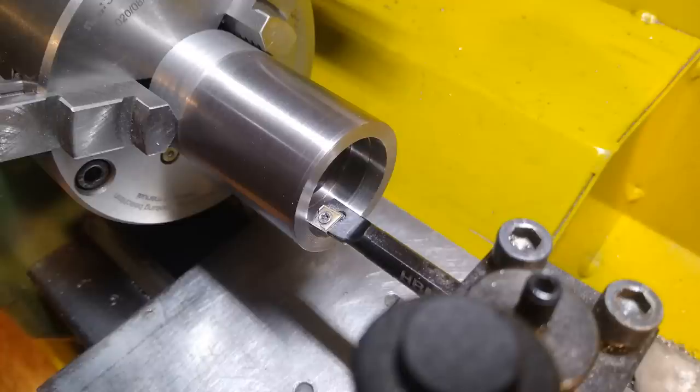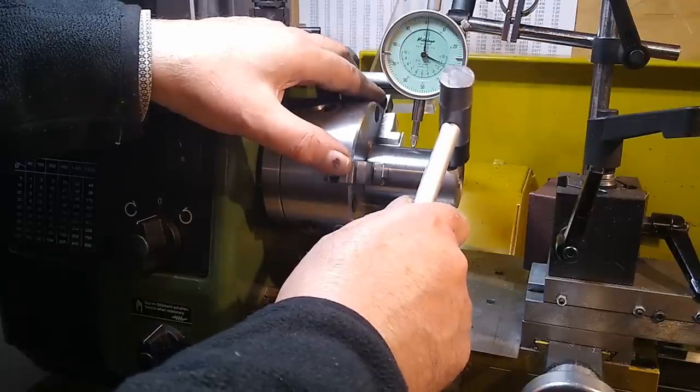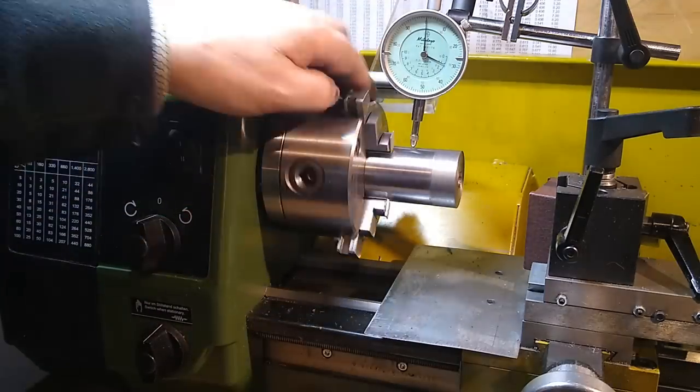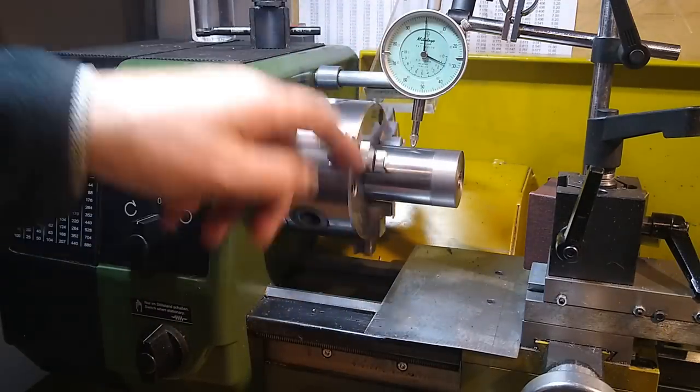This is where the bearing housing is made. It has light press fits for the bearings, and three threaded holes for the grub screws that connect the motor to this housing. If the prototype meets my requirements, I will use precision angular contact bearings with a correct preload later in the final build.